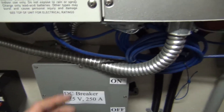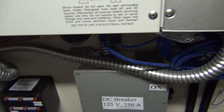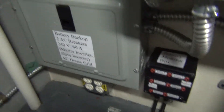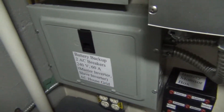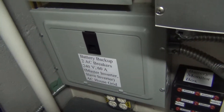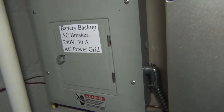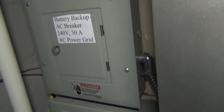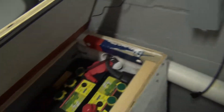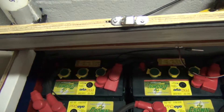And then this is the communication — Ethernet between the boxes; that's how they sync up the inverters. And then we also have our battery monitor box. Eventually this is just going to the grid and also different outlets. We just have some outlets that are strictly for battery backup. And then that's the AC grid coming in, which can also charge the batteries. That's that setup there; I'm going to go over here and get this set up and get it ready with a laptop and start monitoring.